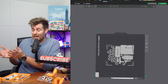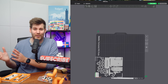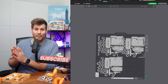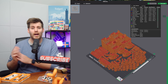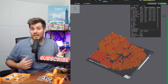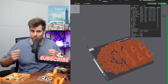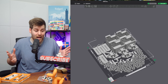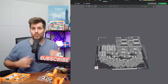If you take a closer look, we're only using about a quarter of the entire plate. So you can literally copy all these products and print the entire batch four times on the same plate. The total printing time would go up to about 9 hours and 51 minutes, but if you do that overnight while you're sleeping, you've literally saved over 12 hours in printing and waiting time, since you won't need to change the plate between prints.